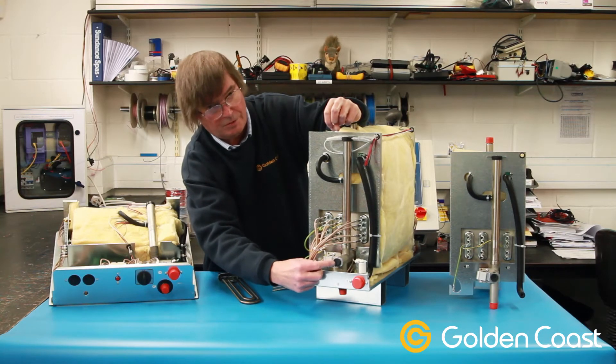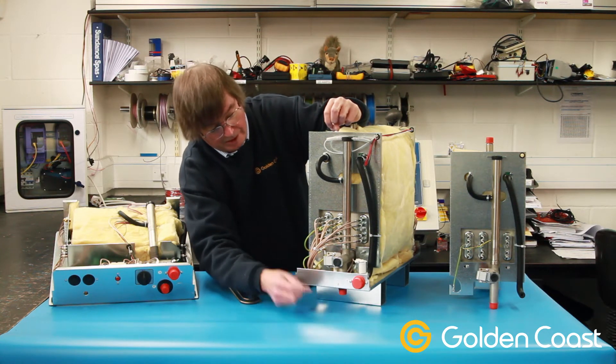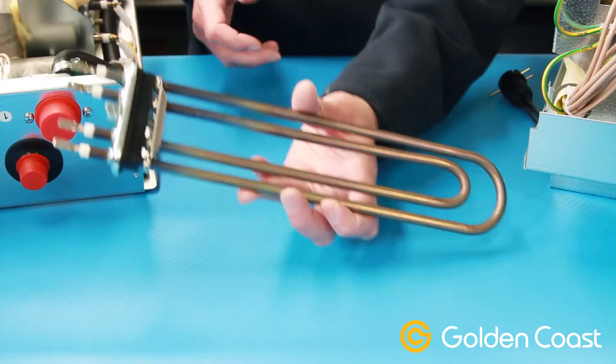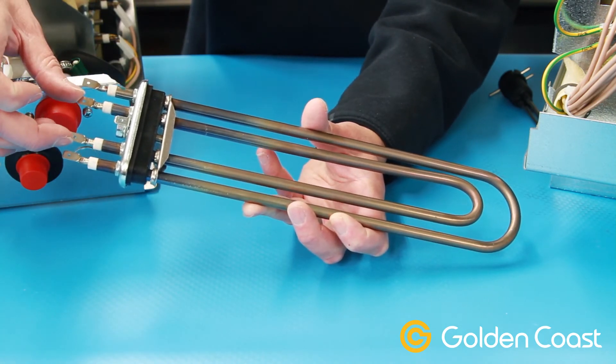This releases the water to the drain. When this water comes out it is boiling hot, so the drain should be made of a material that can stand the heat. These are the ends of the elements — there's a spare element here. As you can see, the top and bottom connections are one element, and the middle two connections are the other element.